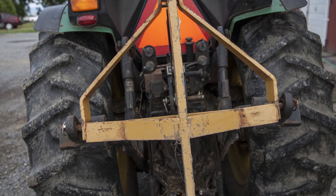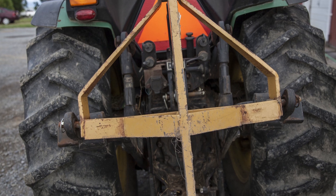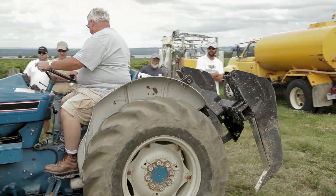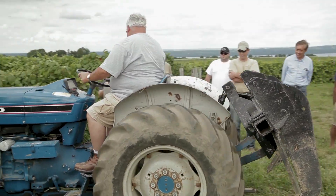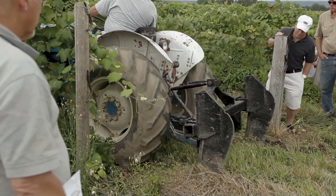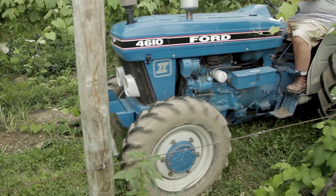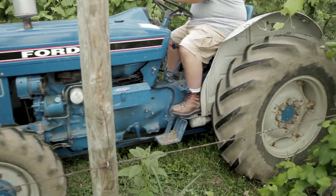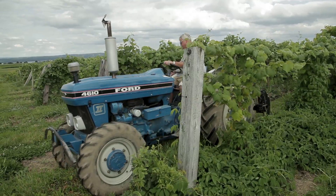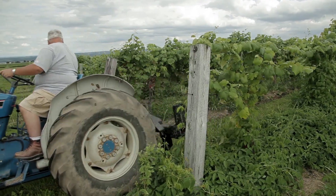This machine may be a good idea for a grower looking to break up compaction from a harvester. If run in the fall, the single shank ripper could help funnel snow melt and spring rains into the soil profile. The double shank ripper was the most effective piece of equipment demoed. It has a working depth of up to 16 inches. When the shanks are adjusted to run directly in the wheel tracks, the results are exactly what you're looking for. This machine was custom built by a local fabricator, though several commercial models are available, and it was able to fracture the multiple compaction layers present at our test site. We recommend a four-wheel drive tractor with at least 50 horsepower to pull this implement.